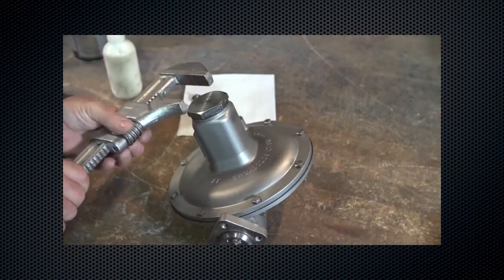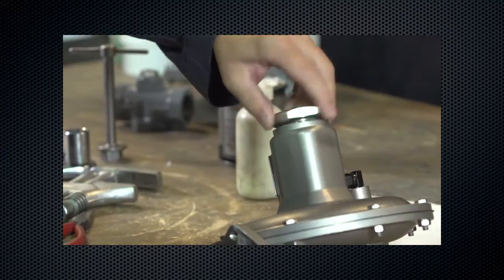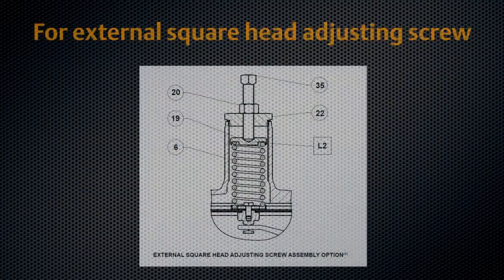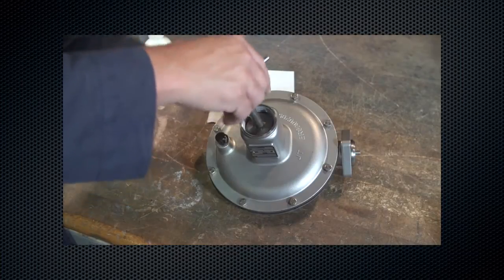Secure the pitot tube with the pitot tube machine screws using 14 to 19 inch pounds of torque. For the internal flat circular adjusting screw, using the 1-3/4 combination wrench, remove the closing cap and closing cap gasket. For external square head adjusting screw, loosen the lock nut, then turn the adjusting screw counter-clockwise and remove.